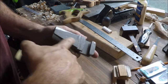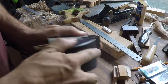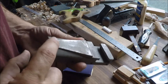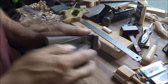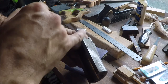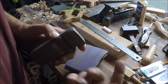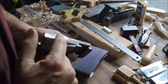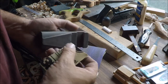I just got some 150 grit sandpaper here. The paint on this thing is a little nicked and dinged up, so I want to smooth this up a little bit. You can see they didn't mill this - I can see the milling marks in it. There are some high points and it's a little bit low right here. Castings just don't come out perfectly flat, so this is sort of evidence of that. Don't ever believe that one of them is perfect.